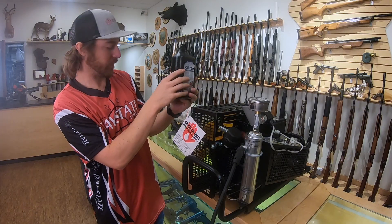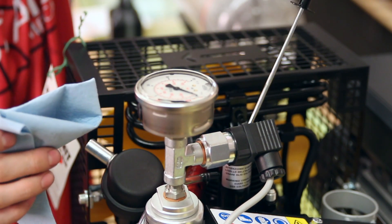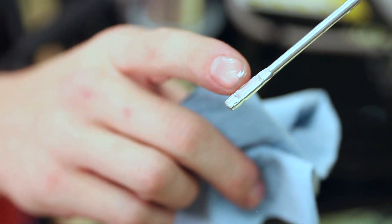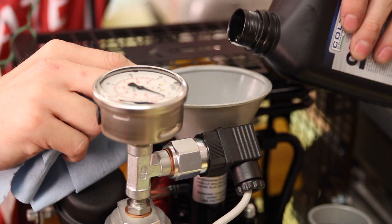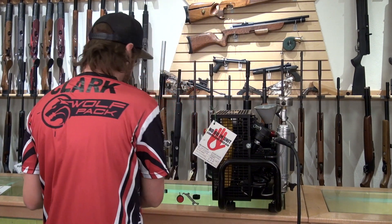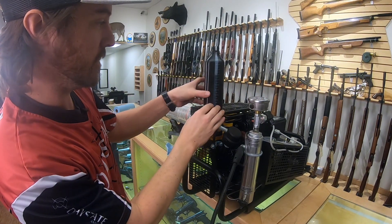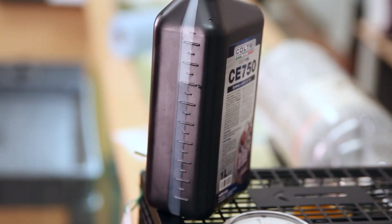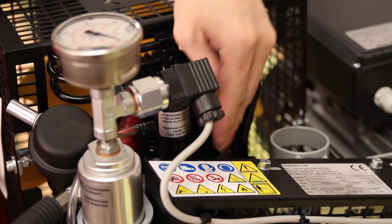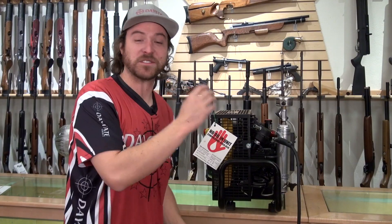You can see here there are some markers — I'm right at the third. Clean your dipstick just like on your car, bottom it out and pull it up. My oil line is registering right below the line, so that tells me there's not quite enough — I want to be right between the two little marks on my dipstick. After adding a little more, I'm in between the two dots. Looking at our liter of oil, it's right at three lines — three-tenths of a liter. Now we know we have enough oil. Plug that back up and always remember to put your vent plug back on — hand-tight, then a quarter turn with a 14-millimeter. Nice and snug. We have oil in the unit and it's ready to start running.